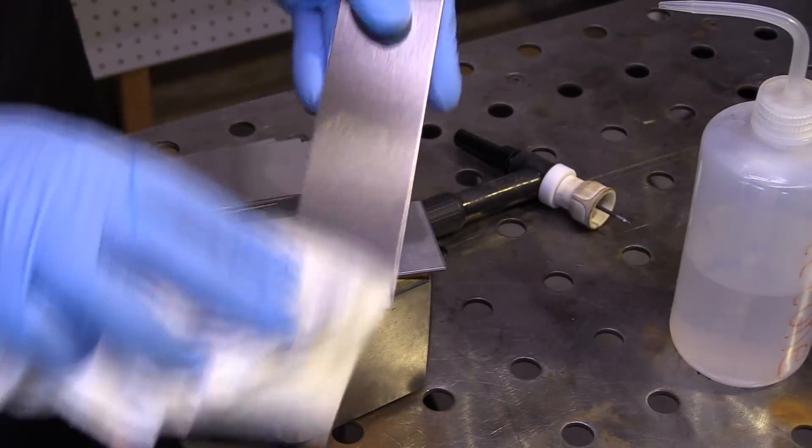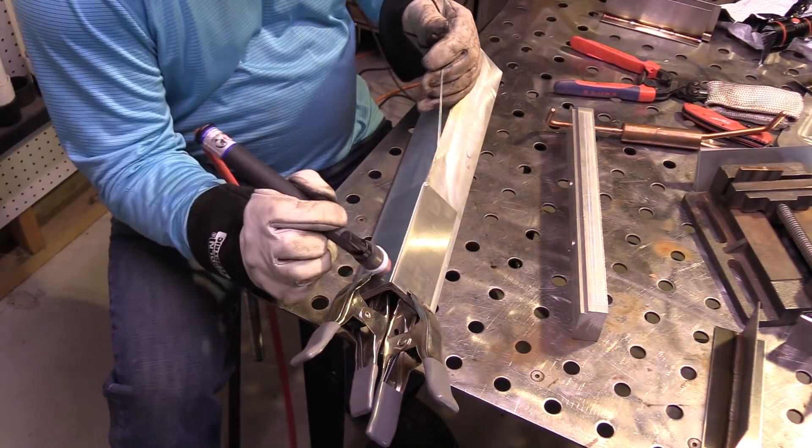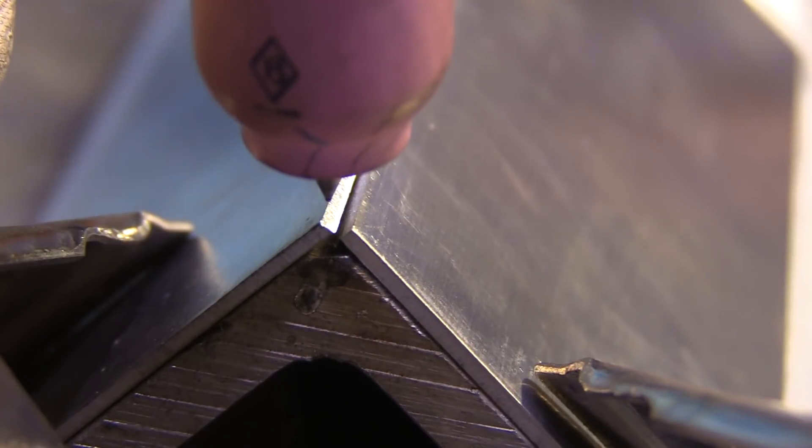This is an outside corner joint in 063 aluminum, 1.6 millimeter thick. I've got it clamped down with some spring clamps to an aluminum angle block, just kind of for a heat sink. When you're trying to TIG weld small aluminum pieces, they get saturated with heat really quickly and then just weld funny. So this will pull some heat out of it and let me weld the whole thing without stopping.